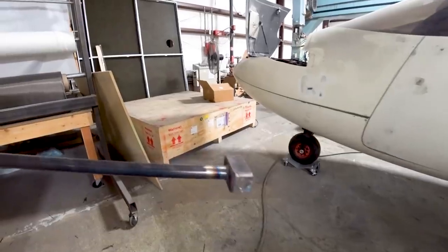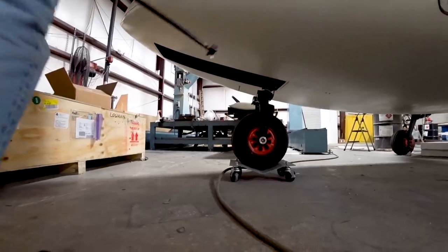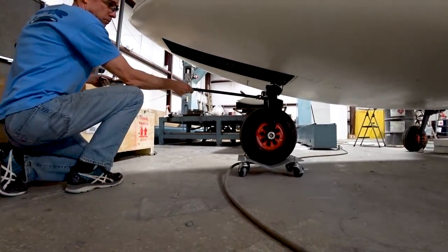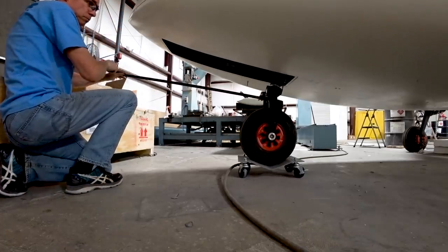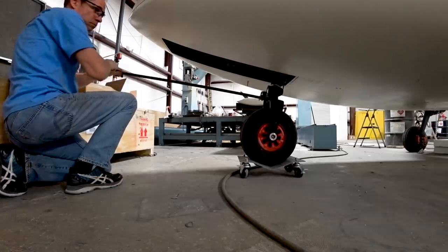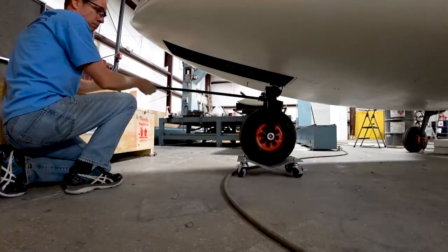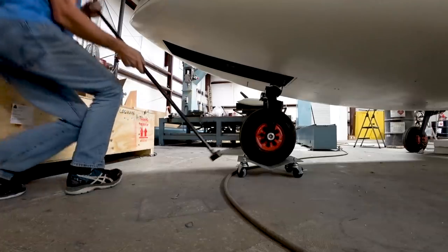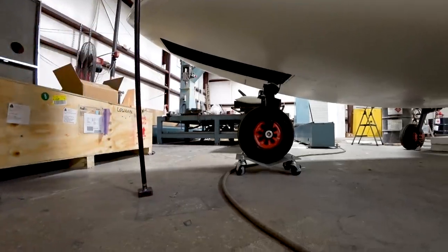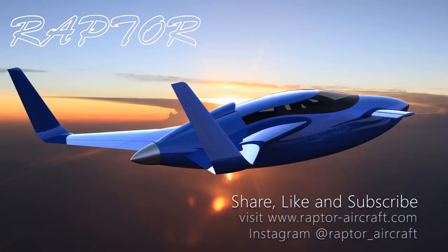Now that the aircraft is back on its gear, here's the tow bar again. I pulled down on the front of the aircraft to compress the nose strut about an inch, and now I can actually steer the nose wheel — it's rotating on the dolly, but it is steerable. So it's towable and steerable. That's our update for the second half of this week — next week we'll be doing more work on the tail plane, firewall, and other things. Tune in again Tuesday — thanks for watching.